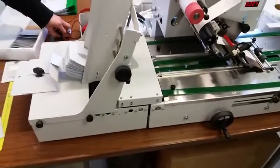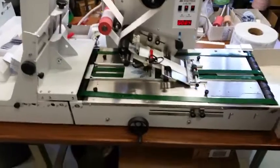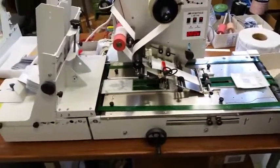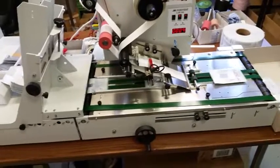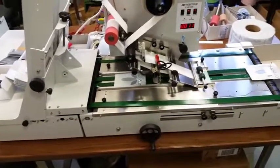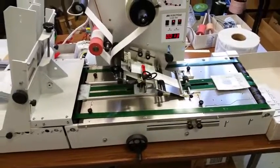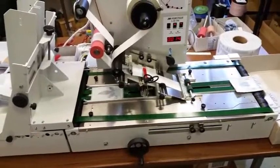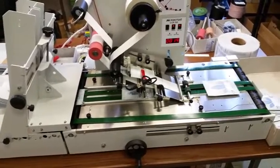The switch is located at the end. The input hopper has a separate motor which runs slower than the actual machine to make sure there is a gap between each product. This gap is needed to separate each product so the labeler knows when to shoot the label onto the product.